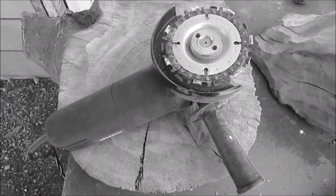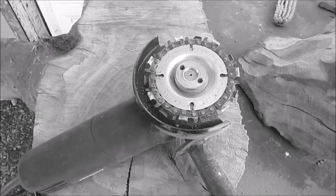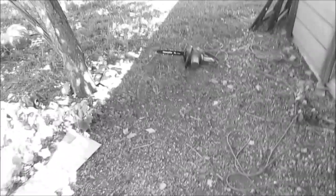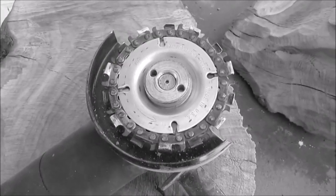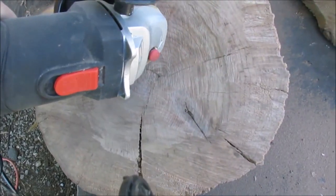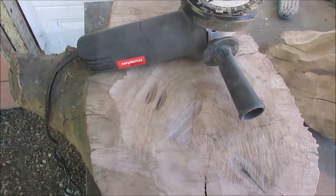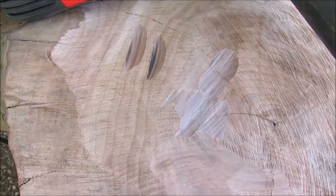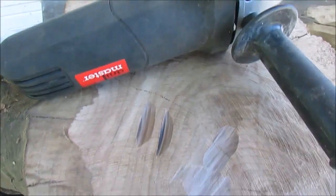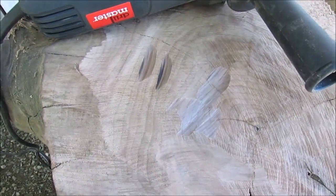I stepped up to my King Arthur chainsaw tool. Now this sucker is way more aggressive — it cuts like a chainsaw. I could have just used my chainsaw, but this attachment on the angle grinder gives you a lot more control. There's a 50% probability I put this on backwards — let's see if it cuts. Yep, she's cutting. You can see by just those quick little cuts that it's way more aggressive. I'm going to make some deep divots in this very quickly, and once I get it roughed out with this, I'll probably go back to my other tool to refine the cuts.